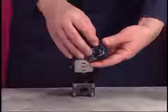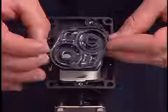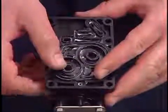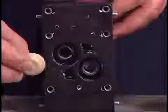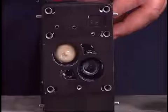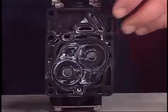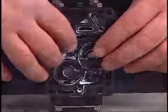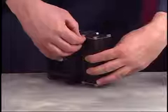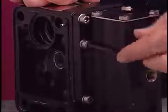Place a new gasket onto the adapter plate. Position the adapter plate over the valve block, making sure the opened end of the track gasket seat faces down, then snap it into place. Carefully install new quick dump checks into the center body. Install the two track gaskets. Then attach the valve block to the center body using the six screws and a 5-millimeter Allen wrench. Torque to 35 to 40 inch-pounds, or 4 to 4.5 newton-meters.